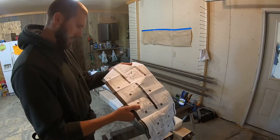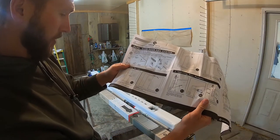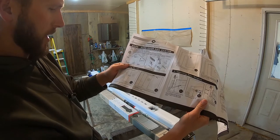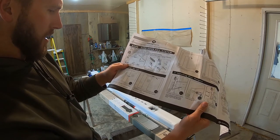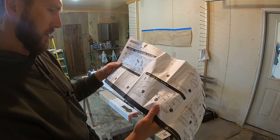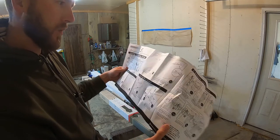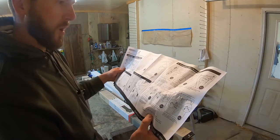This kit says: from the floor, add 1-3/4" to the height of your door being installed to determine the center height of the rail. If it's not installed level, the door may slide since it's just hanging there. All these barn doors are pretty similar, so let's go about laying out the opening and getting the jamb installed.